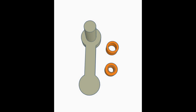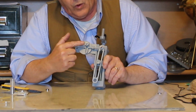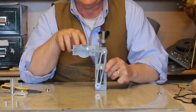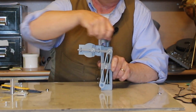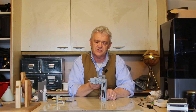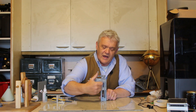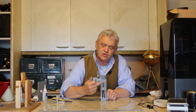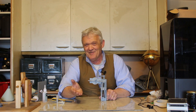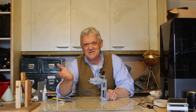I use these bits to make little caps — one, two, three — which stop everything being thrown off. There's also a spacer and a handle so I can adjust the pivot point even while the input shaft is turning. Turning the input shaft creates a throw. That throw is shorter when the pivot is lower and longer when the pivot is higher. Because the throw is now variable, when we convert it back into circular motion with a ratchet, we have a continuously variable transmission.